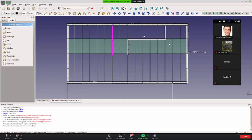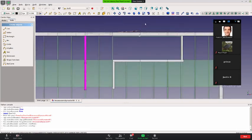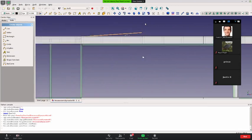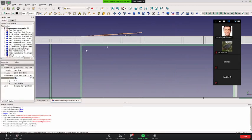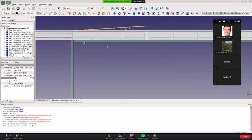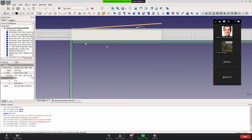And then you're saying on the stairs. Yeah, there's that strip on the north side there. It's actually the west side. So this one here? North. Sorry, yeah, go up. So there's that long strip that's under the wall panels. That one's an adjustment module. If you click on one of those panels, you'll expose the strip. Now you see that joist there, that needs to be corrected, right? We talked about that one. That one's sticking out 1.5 inches. It needs to be punched in to the wall, because that needs to be a smooth wall going straight up from top to bottom. So that one is wrong.